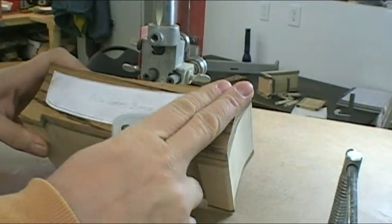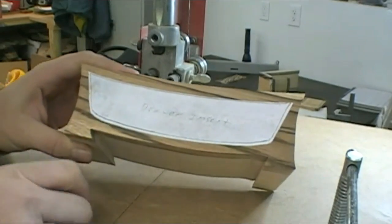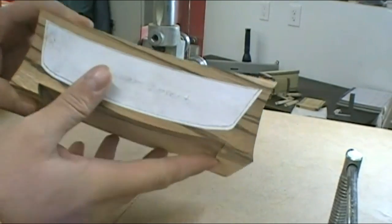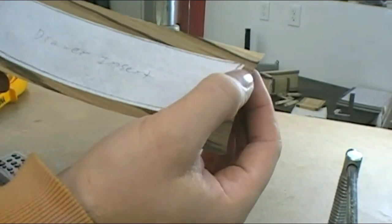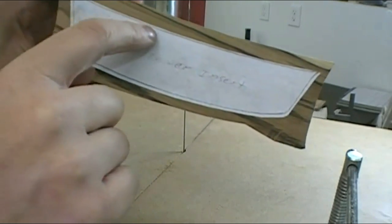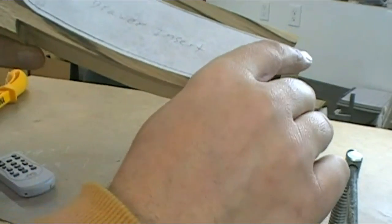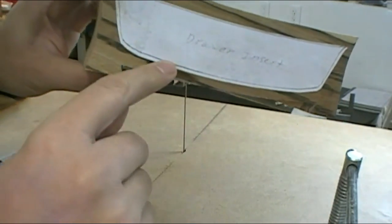Okay, so what we've got here, I've put on my template for the drawer insert. I put it in an area that I want it to be in. Then what I'm going to do is come in from one of these grain lines here, and make my first cut along the top here, and then I'll stop over here. Then I'm going to back the saw blade out after it's come to a stop. Then I'm going to come back in again, come down and do the lower part, come back up